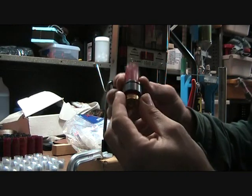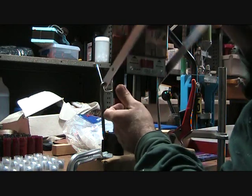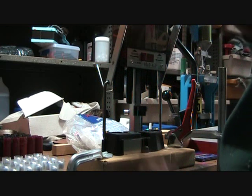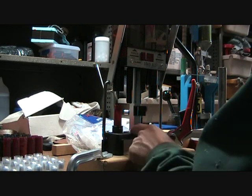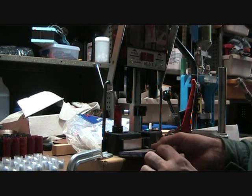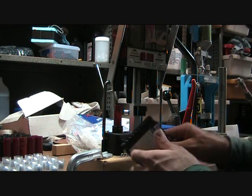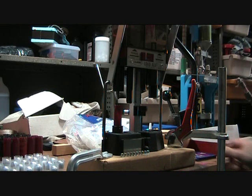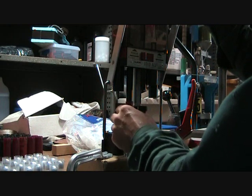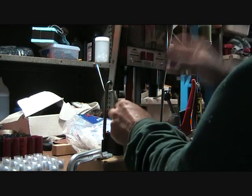So this is the resizer — put the shell up the top, slide it over, put it in the first station. It knocks the primer out and resizes the brass. Next station, we need to put a primer in. All I do is just set a row up here like that, and we drop the primer in there, move this to the next station — it's been primed.